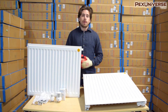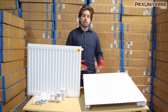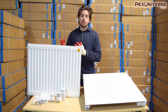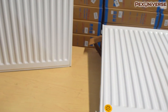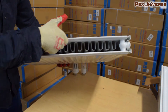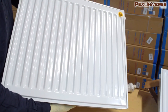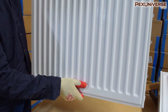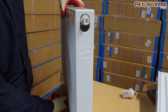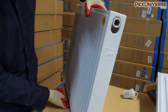The most important thing you need to know is that these are a hybrid between baseboard heaters and regular radiators, like a cast iron radiator, because they use both convection heat and radiant heat. Baseboards work off convection heat, radiators work off radiant heat, and these combine both. Regular forced air or convection baseboard heaters require high water temperatures, causing large temperature differentials in the room. Panel radiators may permit return water temperatures below 130°F for natural gas and 118°F for oil-fired applications, allowing a condensing boiler to condense and take advantage of its added efficiency.